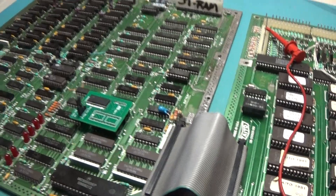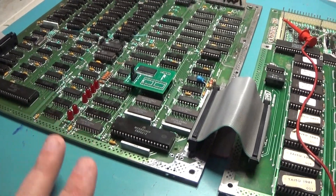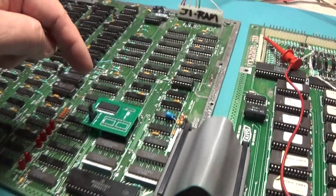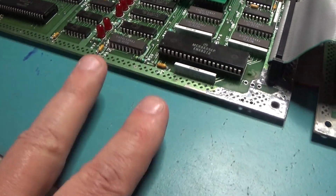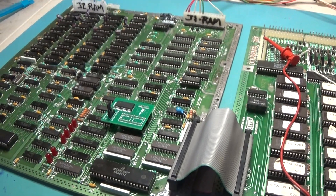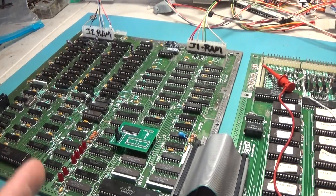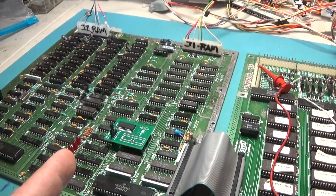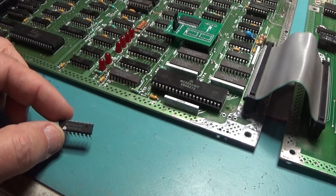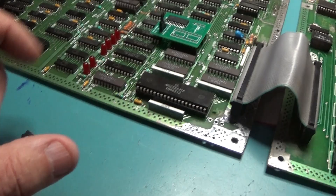I have made more of these to fit other games too. I'm going to have one for a 6116 basic RAM NV RAM where this chip fits right in the middle of the socket holes, so it'll work for any game that has NV RAM with a 6116 RAM. I'm making a board for that, and also one for something that uses a single 6514 or something like that. It's a little overkill because this is an 8-bit part and you're only using four bits in that situation, but you'll still be able to use one of these for that.